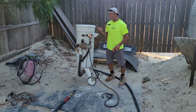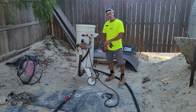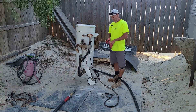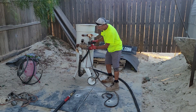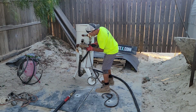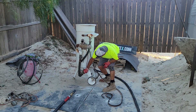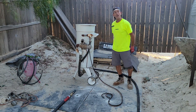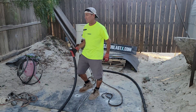All right, so you rented this sand pot and you have no idea how to use it. I'm going to show you real quick how to use this. Sand goes in there, air goes in here — the air compressor delivers air into here, pressurizes the pot, the air travels through this hose carrying the sand with it, coming flying out this end. And you're sandblasting. That's the basics.